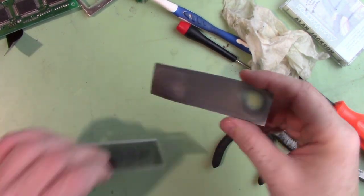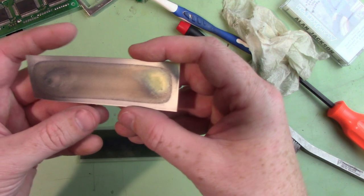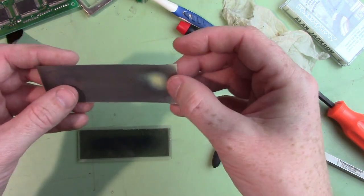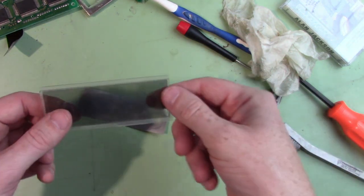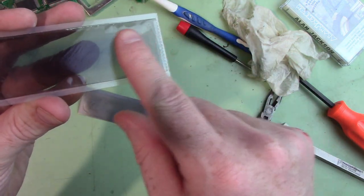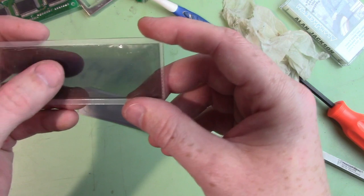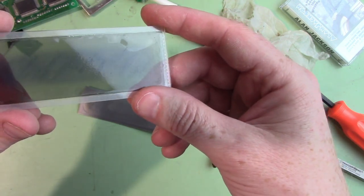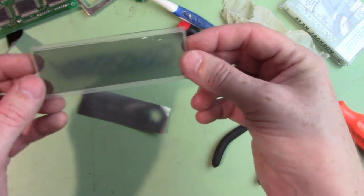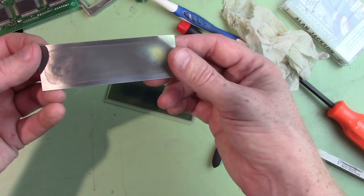I ended up heating the foil on the back with my heat gun and it peeled off — you can see that's the discoloration. This is an adhesive on the back that glued it to the glass, and I'm guessing the adhesive is what discolored. I'll see if I can clean the adhesive off with some alcohol and glue it back on. There is some discoloration in there, and the polarizing films are not laying flat anymore. I'm hesitant to mess with that too much because the screen was working before.